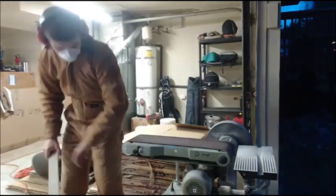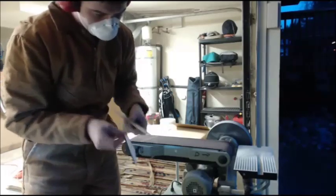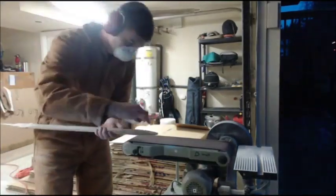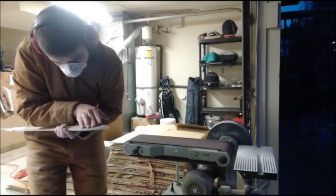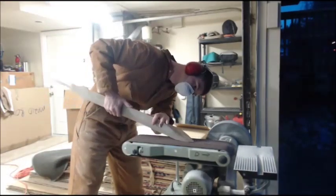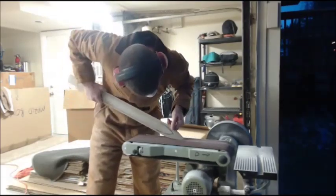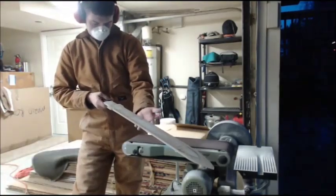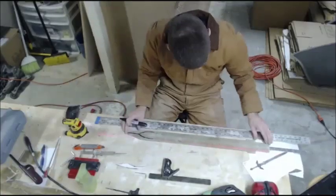Now it's a matter of fine tuning. It is actually a pretty precise amount of control you have at this point. I'm just checking the fit using the template again, making sure I have a nice smooth transition on both sides. The last thing you want is to be out of round or to not have a perfect tip on the blade — it's going to throw the whole thing off. It's amazing how good the human eye is at seeing imperfections of symmetry. So I took a lot of extra care to get the blade exactly symmetrical. Sometimes you need to step back, walk away, and come back to take a second look.